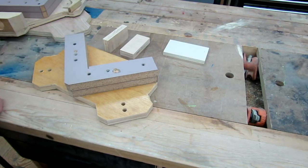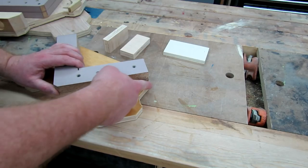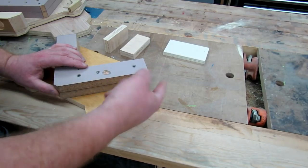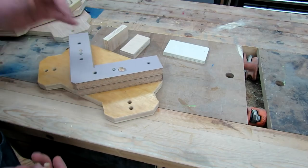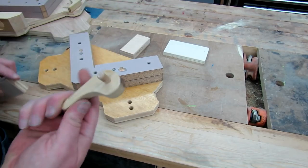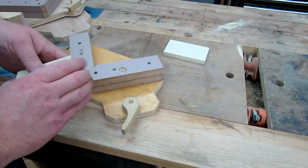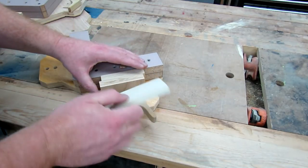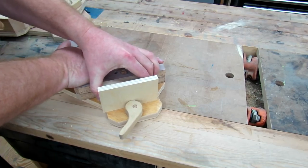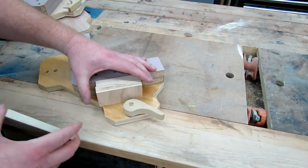Here's my first iteration. I was cutting out this section here because that's kind of the way it was on the Rockler version, but after I started paying attention to that, there's no reason to have it there — it really serves no purpose, so I just left that straight. Then I used these cams here with a 3/8 dowel, and believe it or not, this holds really well. You kick that back, put some pressure, and I cannot pull that out of there. So it's fast and it works, but it's just not as quick as having a threaded screw.